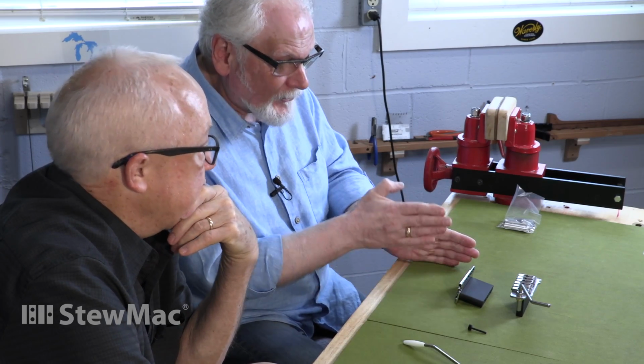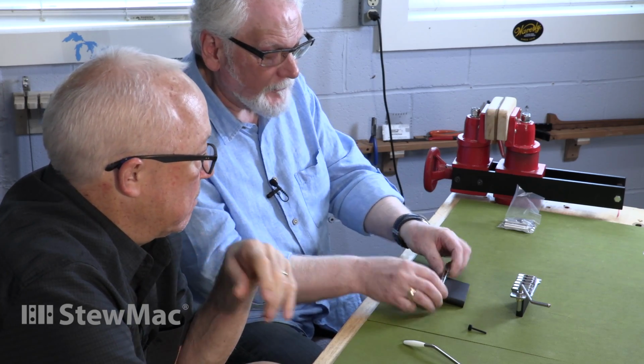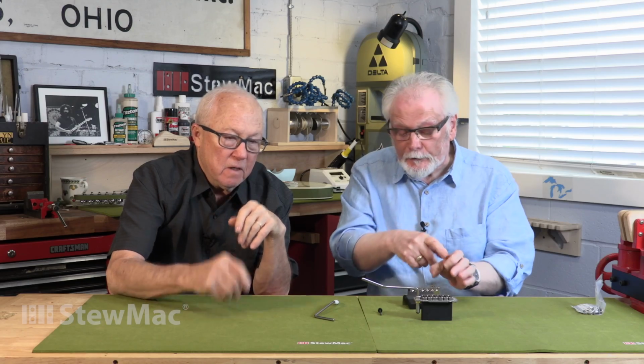You know as well as I do that you can have a CNC machine. That CNC machine can put those holes in that body absolutely perfect. But it's the screw that's going to decide how it's going to go in that hole. You've got no control over that screw. If it wants to go in slightly at an angle, or if it wants to move over to one side, it will do it. And once you've done it, you can't fix it. So if you've got 6 holes, you can't get 6 screws absolutely perfectly aligned. So you can get a binding, because the screw kind of locks itself in the circle. A little bit either way.